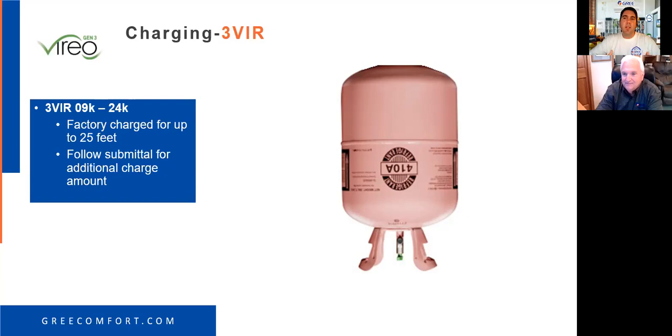The superheat on these can vary up and down with that inverter. You've got your expansion valve adjusting, you've got your compressor adjusting speed. If you created a chart, it'd have to be 10 pages of charts, depending on what outdoor temperature, what speed you were on, all these different things. So that's the reason behind weigh in.